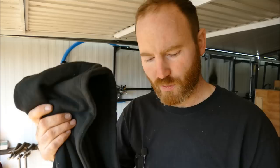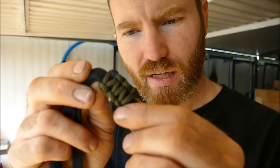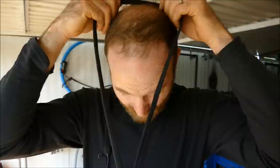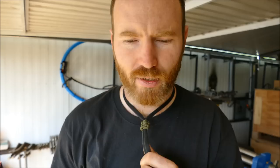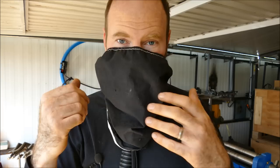I like to wear hoodies but I took the cord out of mine — they're a snag hazard anyway. So I made a neck loop and put this cord on with a cobra knot, which acts like a locking toggle. I'm going to wear this like a lanyard. I'm now wearing the Myra Safety one — it just hooks there, I adjust it till it's comfortable. I put an extra plastic sheet inside my buff so it goes all the way to the bottom, making it now universal. Flick it up, switch it on, and you can tell it's working because it's actually inflating the mask — I can feel the air escaping around my face.